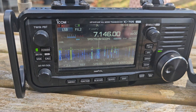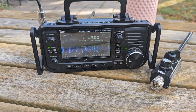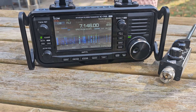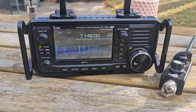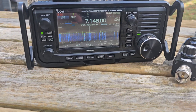This is what you can do. If you're on a low budget, I would experiment with different lengths of wire — that's my advice. You can buy antenna tuners at such a low price now. I recommend the ATU100M — it's on AliExpress, just such a low price, and it works really well.